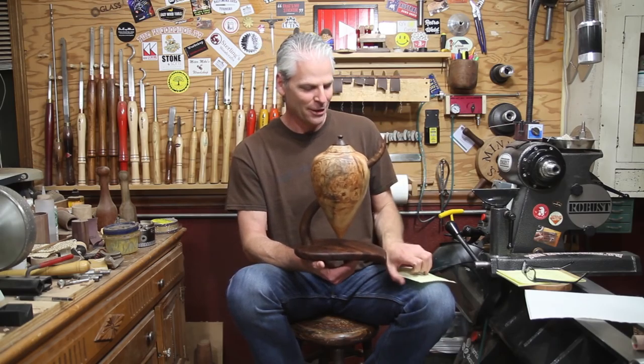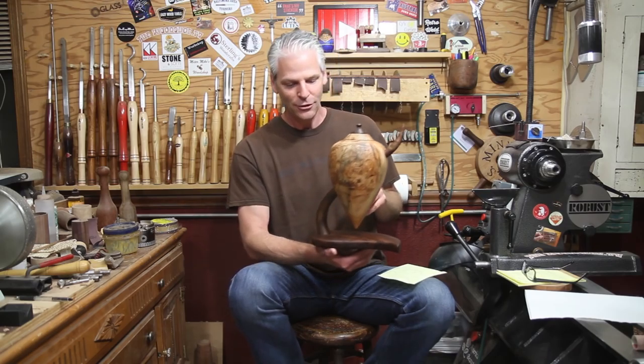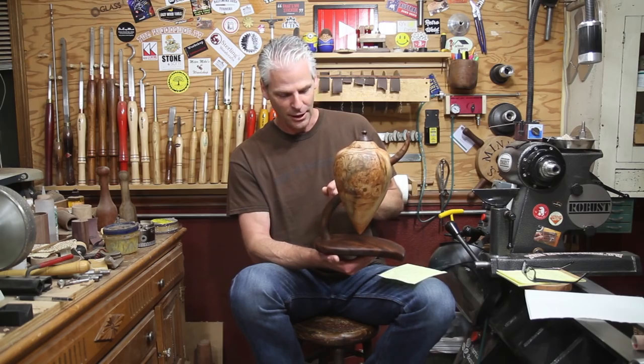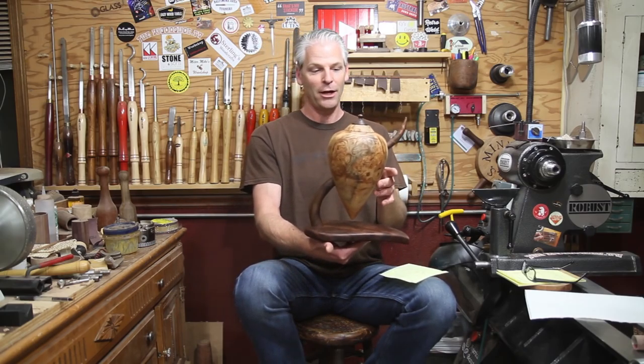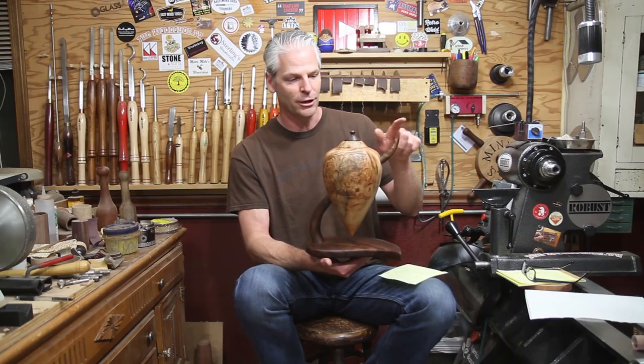This was Friday's project - this maple and walnut urn - and I'm very happy with how it turned out. It almost looks like the sketch I did, which doesn't happen all the time. One question was how I worked through a project like this where I don't have plans. The arm was much bigger when I first started and I just kept cutting away at it until the proportions were right. I'll often make something a little bit larger than it needs to be until it evens out. I was always going to do it in two pieces - I wasn't going to try and weave it through there, and the holes were so small it would take up volume on the inside.